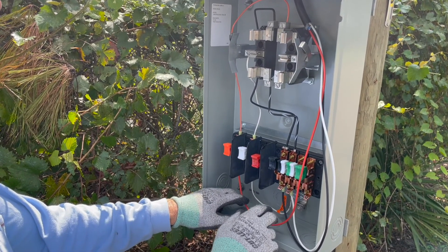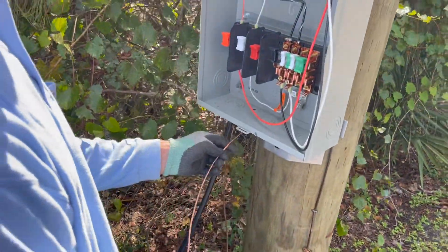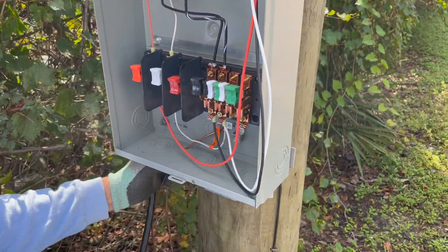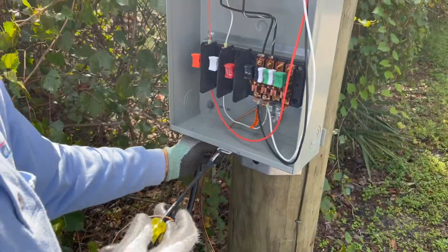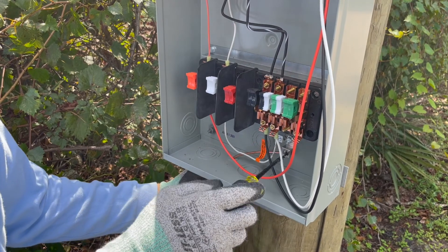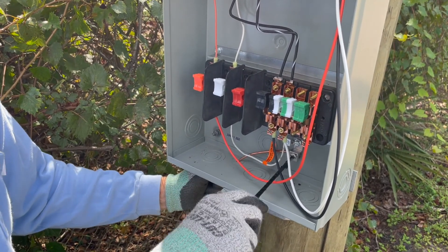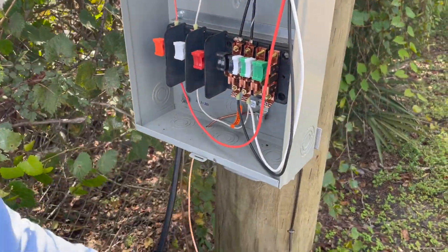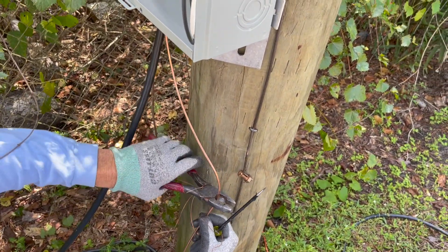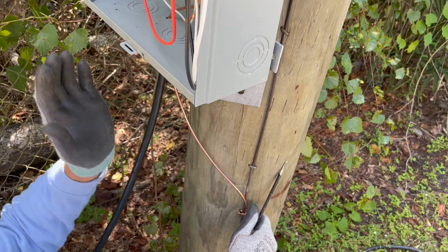I'm completely finished wiring the two-wire meters that came down the pole for the meter equipment. Now I'm going to go ahead and put a ground on it — all these cans need to be grounded. This is a safety thing: if something ever backs into this can and voltages go to the can, I want to have a ground. Here's my grounding wire. I'm going to cut this and put a split bolt, tighten that up, and now my can is grounded.